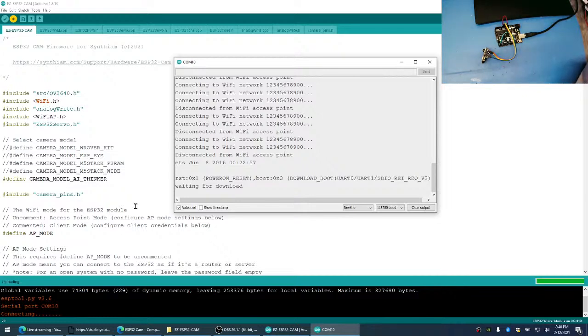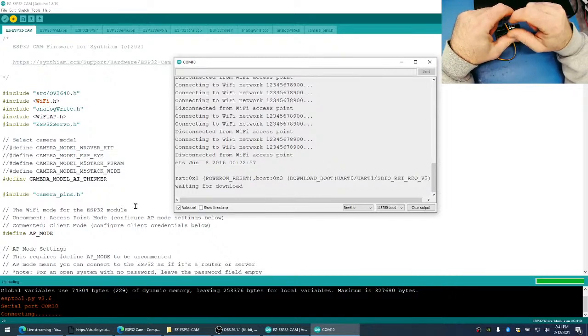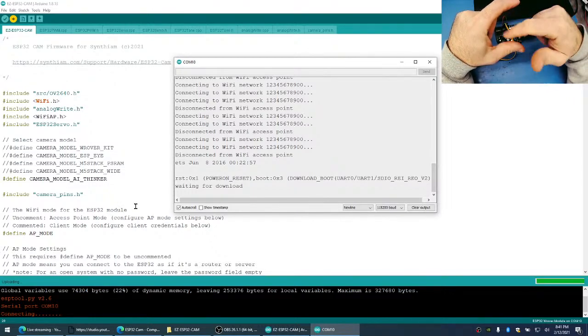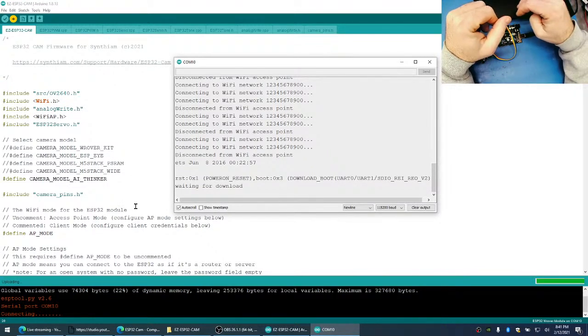I think what would be nice is if Easy Robot created maybe a shield or something for the Atomic Pi, or not Atomic Pi, the Rock Pi, some sort of little board that didn't have Wi-Fi and didn't have the things that are necessary, but allowed you to plug in a bunch of servos into a small little computer. It doesn't have to be a shield either, because if it wasn't a shield, it can be something that can work on any micro or SBC, single board computer. So a tiny little circuit board without the USB, or without the Wi-Fi chip. All it needs is just an STM32, and it can have a built-in serial to UART converter. So it'll automatically do the converting, and then it has just a bunch of GPIO. I think that would be great. Maybe even an amplifier, so you can plug in audio and it can amplify it. I don't know. It might be neat. Jeremy's sitting beside me, so he's listening.